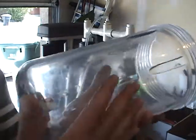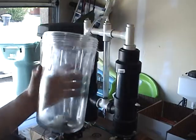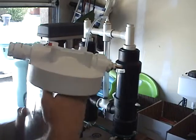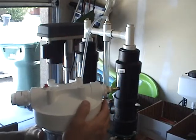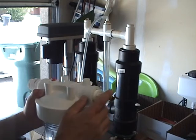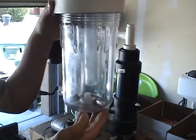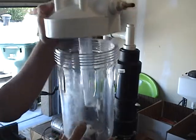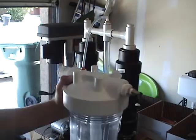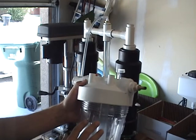From there it's going to go into this bubbler — it's about a gallon, a pretty big bubbler. It's going to go in right here, bubble through this one-inch pipe, and I'll put a little bit of stainless steel wool right at the top here to keep it from sloshing around.